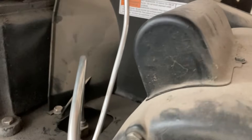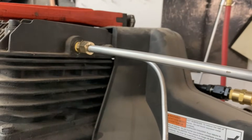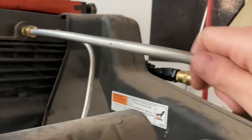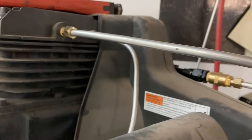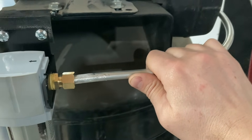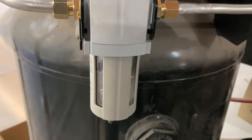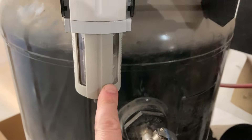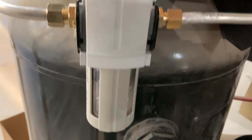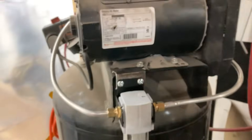I fired this up — just held the line down — and within 30 to 60 seconds of running, the inlet pipe gets so hot I can't touch it; it actually burned my hand. The pipe coming out of the cooler is room temperature — it actually feels cool to the touch. I'd guess this pipe is probably around 120 degrees and the outlet pipe is around 60 degrees. There is a ton of water coming out into the water trap as it runs. This is an auto-draining filter, so once the pump shuts off and the pressure relieves, it should drain out automatically.